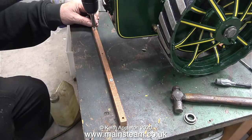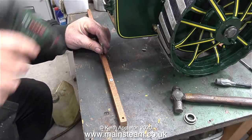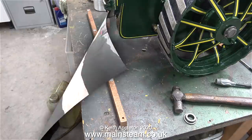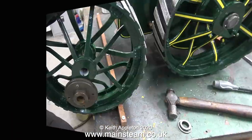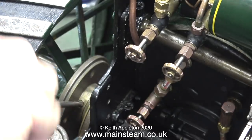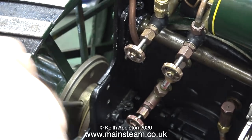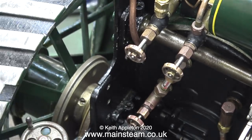The next job is just a safeguard: fitting a piece of wood to the bench to stop the traction engine accidentally rolling off. I split the wood with screw number five, but nobody's perfect. It's now time to fit the other wheel that I've also cleaned up. The part that's swinging about is the drive plate, and this is screwed to the axle with a long slotted grub screw that goes into a hole in the axle itself. Once fitted, everything is very solid.